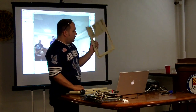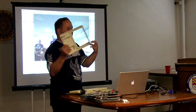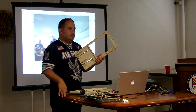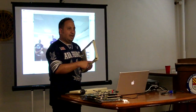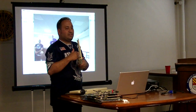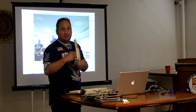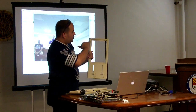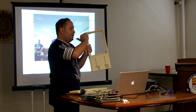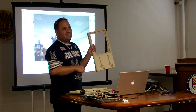It's our first batch. On these, most of these plastics, the badges have a hole in the back. What you want to use is a blunt object, preferably as big as the diameter of the hole that you've got, and push slightly. Don't go like this because you're coming right through the front of whatever's there, and you certainly don't want to use an awl or anything pointy because you will go through before you push it off. Second from that, a very thin flat screwdriver on the sides. Don't start doing this right away. Try to push it.